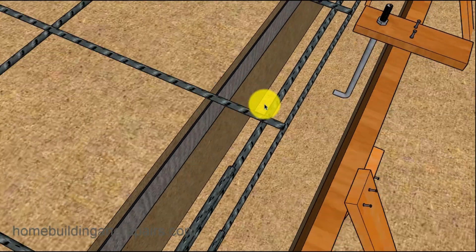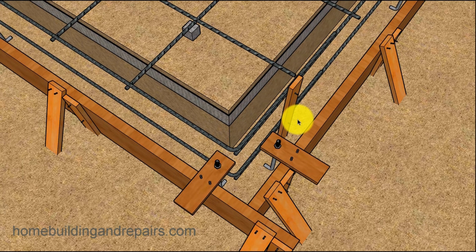So if anybody has any clue on that, feel free to share it with me. I've always made sure that my anchor bolts were longer, so I didn't have to deal with that. It wasn't too difficult. I'd go down to the lumber yard, and they would have 12-inch, 14-inch, 16-inch anchor bolts. I would just get the 14 inches for something like this, and the embedment was about 8 or 9 inches. I was fine with it.